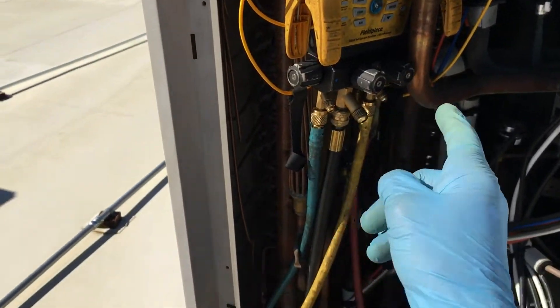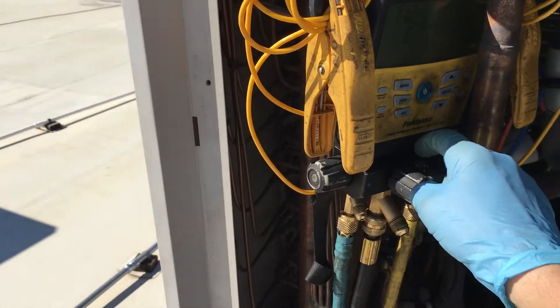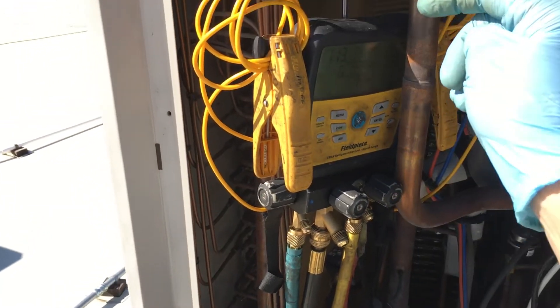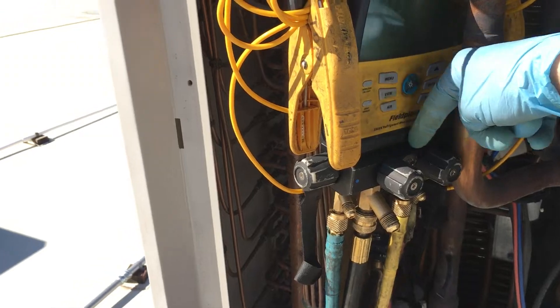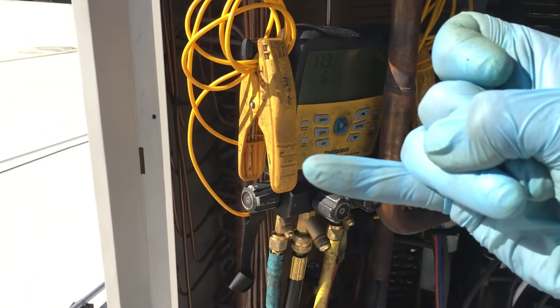But look at this — look where we're holding: 110 microns. This is the difference between leaving it on vacuum overnight and literally drying out the contaminants from inside your gauges. The gauges are all closed off now and the micron sensor is located here in the center, right inside the middle where that sight glass is, in this little section with the volume about my pinky.